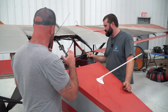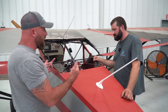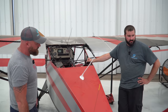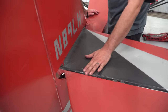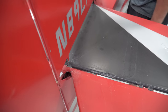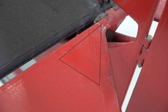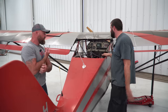So those were the two cool things you came across. Let's go down through the list and see what all we have to fix before this thing will fly. There are a couple of service advisories back here — there's a weldment on the horizontal stabilizer that has a gusset that has to be reinforced. Greg feels like it's already been done and is already in compliance. There are a couple more service advisory items to go over, but let's give an overview of what's going on.